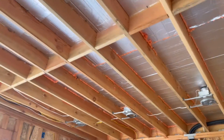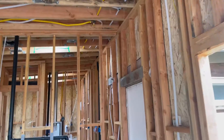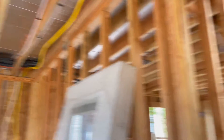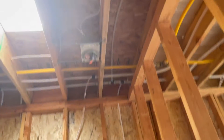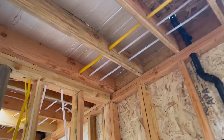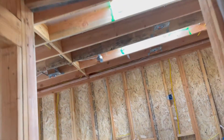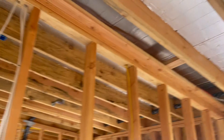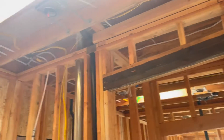Let me tell you, it wasn't fun cutting every single one of these little pieces and sticking them up there, fishing the insulation between gas lines, water lines, and electrical lines. We're pretty close — just about 14 pieces left in this one section. Then we'll go back through and use spray foam for any little gaps and joints to get it as tight as we can. It won't be airtight, but that's not a big problem here in California since it doesn't get that cold. In a colder climate it could be a problem — any air getting through pulls hot air up, creating condensation and moisture in the ceiling.